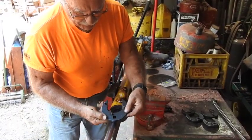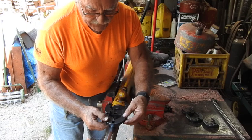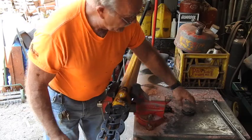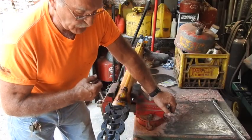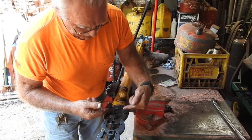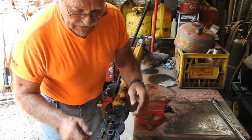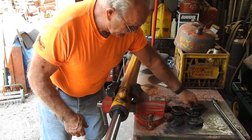This is a series of spanner wrenches that you'll need to hit just about every cylinder you have on your tractor. There's obviously a variety of diameters of the cylinders, and if you have this set right here, you'll be able to spin these off virtually any one of the cylinders and make a repair. These have hardened steel pins inside that line up with holes inside the head, and you'll be able to use a half-inch breaker bar to break those things loose — providing it will give way for us, and there ain't nothing that ever says it will.